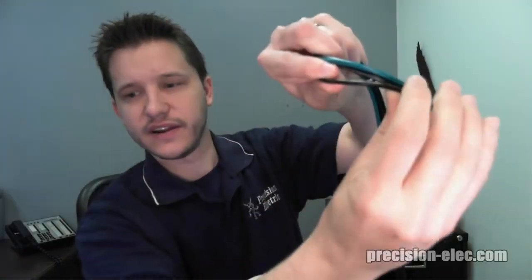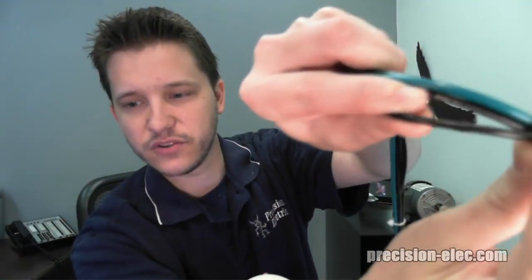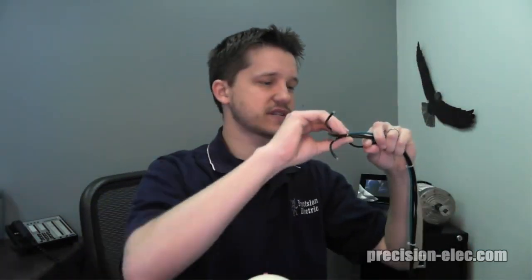You can look up wire sizing charts to make sure you're using the proper wire size for the current draw of your motor. The current draw is the single most important part because that's what generates the heat — you can burn up your wire, cause shorts, and really damage your equipment if you don't properly size your wire. This guide on the chart tells me I need 14 gauge. I checked my wire and it says 14 AWG, which is 14 gauge, so I'm good to go.